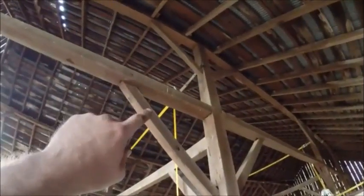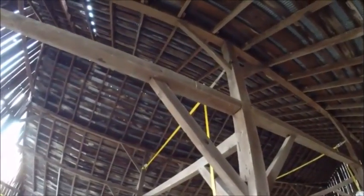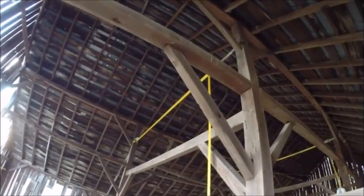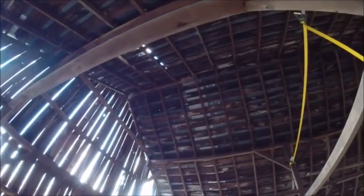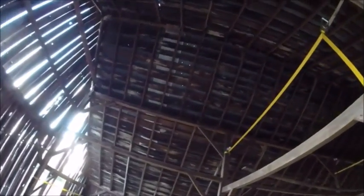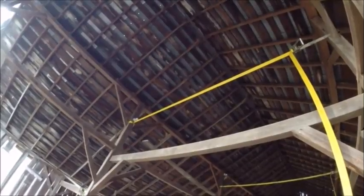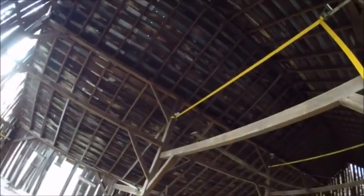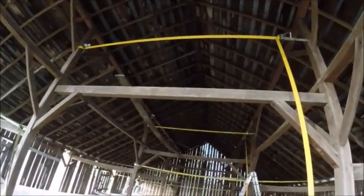and they're going to sit on the top of the braces for the bridge, and that'll allow the bridge is 4 feet from the top, from where it sits on the rails to the top. So by doing that, these are going to be 20 feet posts, so it'll sit 4 under that, so it'll give me a 16-foot hook height, which is a good height to be. You can unload semi trucks and stuff pretty easy, have a little extra clearance, and the rails are another 20 inches, so they're not quite 2 feet. So it's going to be 14 feet clear inside of the building, everywhere, under the beams and everything. So it should be real easy to move stuff around in.